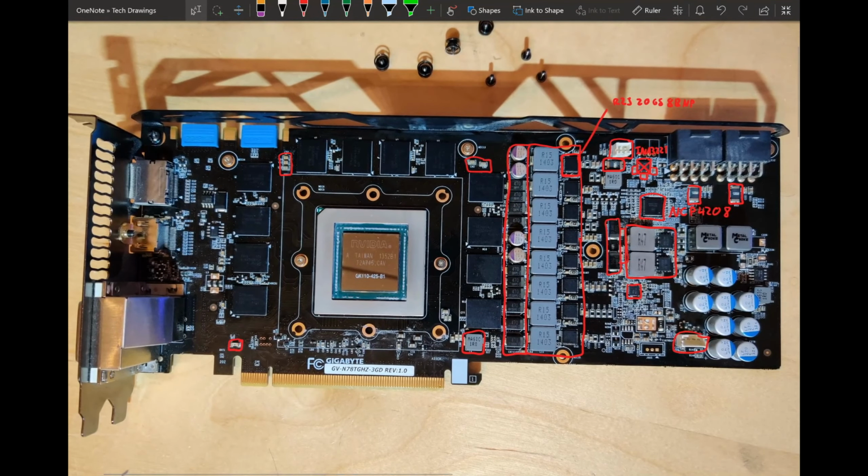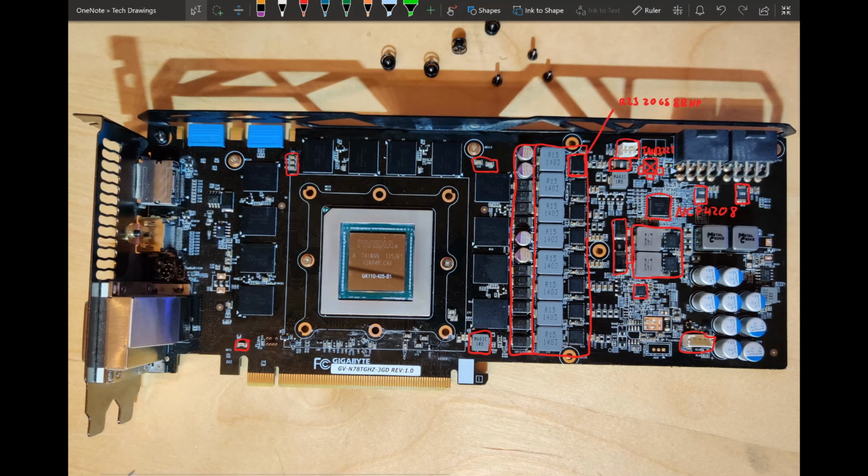So yeah, the PCB is decent, I would say. It's okay. It's not the best one. The 780 Ti Matrix has a much more powerful VRM. And the 780 Ti Classified, same thing. And then even the Jetstream and the Phantom, like Gainward and Palit, use the same PCBs. So the 780 Ti Jetstream and the 780 Ti Phantom use the same PCB. They just come with different coolers from different brands.